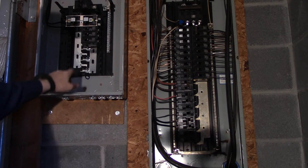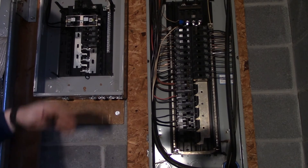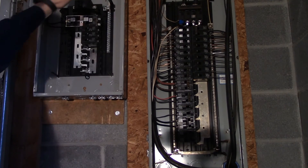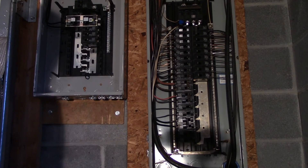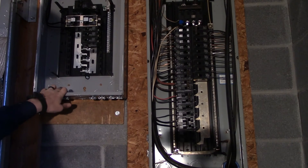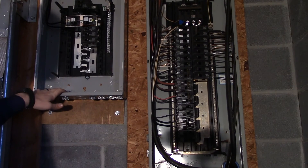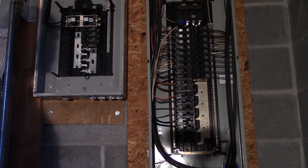I don't have enough breakers to complete the task today. When I get all the breakers, I'll need 16 single pole. Right now I've got three on this side. I'm going to get new ones and move the wires over into this panel over a period of time, rather than pulling all the existing ones out and switching them. The reason is I want to make sure the inverter will run everything. I'll move one wire over at a time each week to find out how much the batteries can handle, and if I need a bigger battery bank, I'll get one.